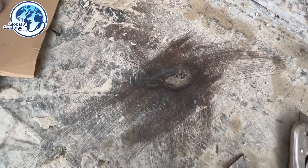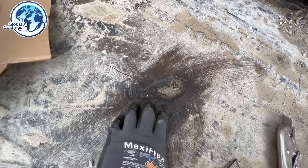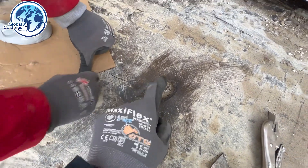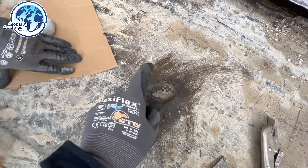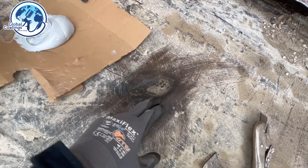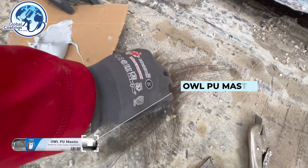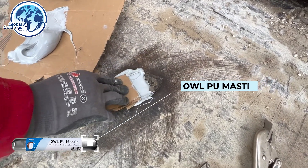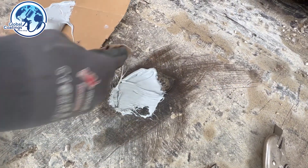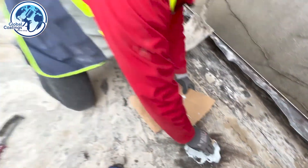Here we made a hole using the Kangoo and we're taking the tiles off. In order for the roof not to leak when we're power washing, we have to temporarily repair those patches before we start. We've prepared the cut, cut out the slice of felt, cleaned it using a wire brush, and now we're going to apply the PU mastic. Remember, this is only a temporary repair — we don't want to flood the house while we're power washing.